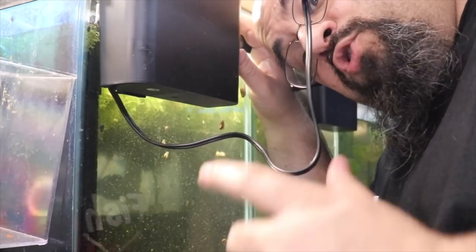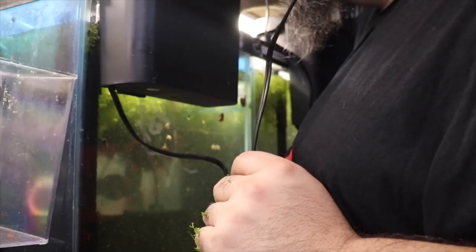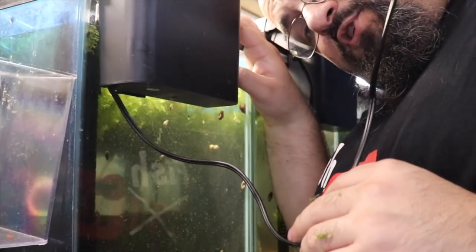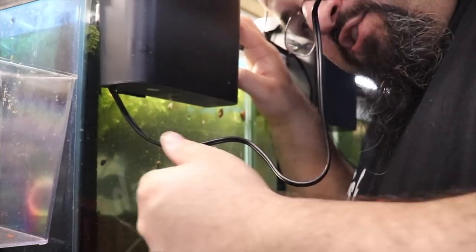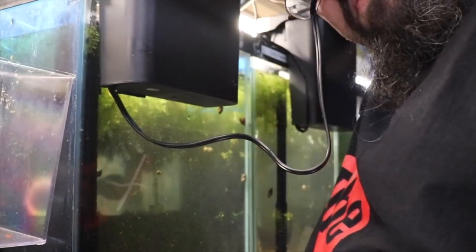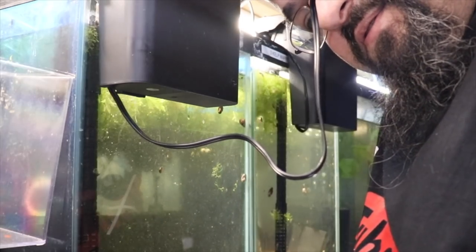It's almost there. I'm going to help it again. Another trick: the water has to suck up through the tube and push through the filter. If your filters are clogged, if you take the filters out and it starts running much easier, it's time to change your filters. In this case I'm going to take the filters out to see if that helps start the flow. There you go — water's flowing! It's much quieter now. So then we put the filters back in, because that's how we roll.